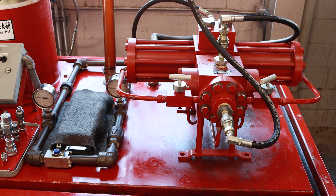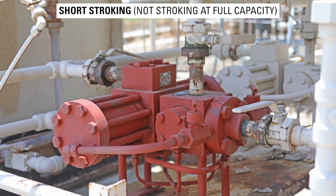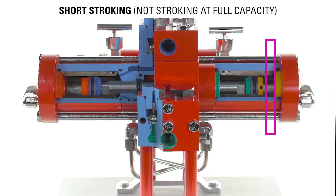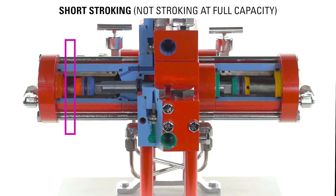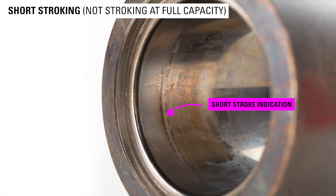The main thing you want to listen for is when the pump is stroking evenly. When the inlet needle valves are not evenly open, this causes short stroke. If the pump is short stroking — meaning it's not pumping at full capacity, only going halfway before going the other direction — you aren't getting full flow rate. This wears out the cylinders faster because it's only using part of them, and the pump has to work harder to circulate the right amount of glycol through the system.